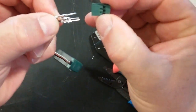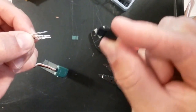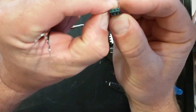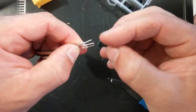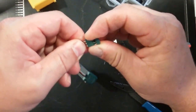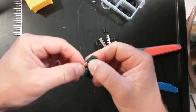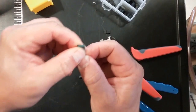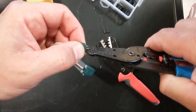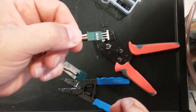So we're going to go ahead and slide that in again. Check that the wire is on the right-hand side, check that the plastic is going all the way into the crimper, go ahead and crimp it. So we have the three pins back on the wires, and now we're going to go ahead and push those back into the component. If this green component is not working correctly, you can go ahead and add these in — this comes with the kit. The three pins are just the same size as the green pin, just without the extra flap, so it will work in the VEX Cortex — it'll just be a little bit loose. Check that you have it on the right side. These are a little bit tough to get back in sometimes, so just push it back in a little bit, trying to get it to stick out the front side. Occasionally you have to control those a little bit — use the ends of a tool to pull them through, going one at a time. Then just push the clips back down, and there we have it — it's all fixed, good as new.